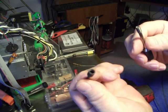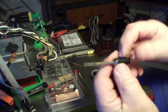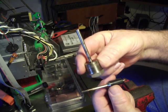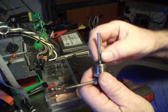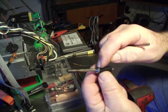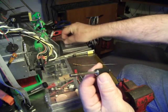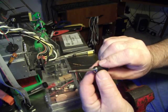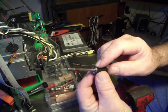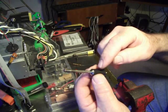This tip — I've had these for many years — it's a quarter by 20 thread. What I did was I took a stainless steel tube off of a Frymaster fryer probe and just cut it off right here, so that left the stainless steel tube with an end on it. Then I just press-fitted that inside of the soldering iron case and swedged it around inside with a countersunk screw, pounding it down a little bit to where it formed to the contour of the inside of the case.